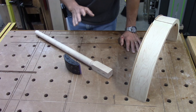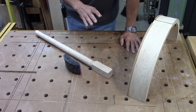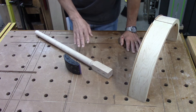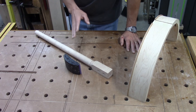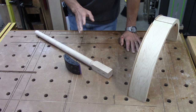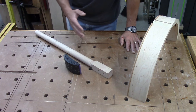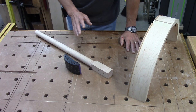All the parts are complete for the table itself. The tabletop is done, sanded, and the first coat of oil is on it already. So I need to start doing the surface prep for the aprons and the legs. I'm going to use a sanding block and some loose pieces of sandpaper. I'm going to start at 150, then 180, 220, and I might go up to 320. This is going to take some time and it's pretty boring, so I'm not going to videotape it, but I just wanted to give you an idea of what I'm doing.